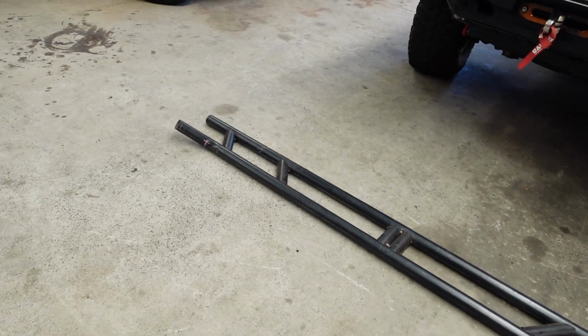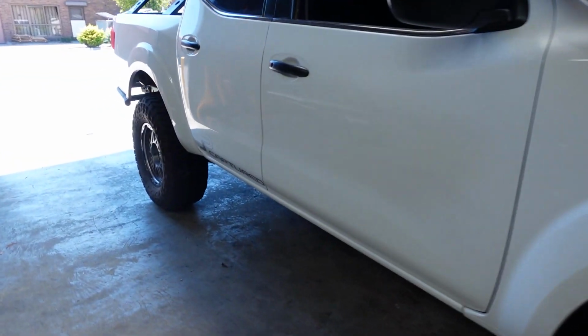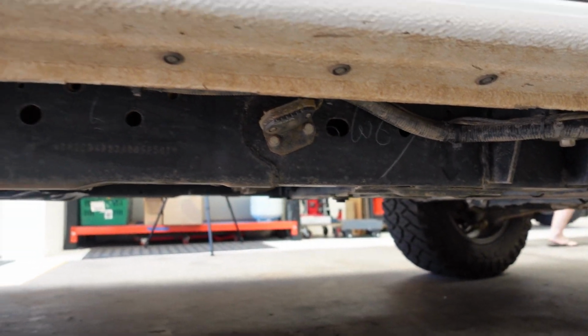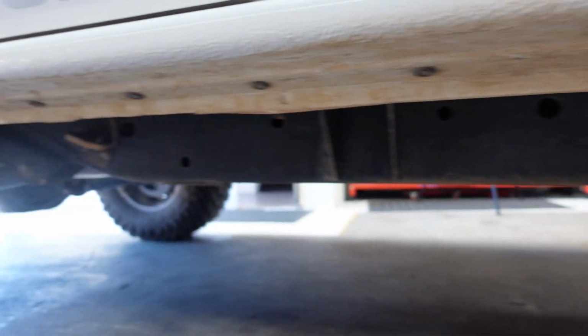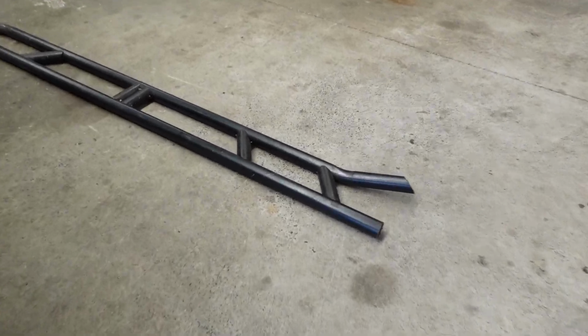Hey, Amy. And so this is the driver's side one. It's got a bit of a kicker on the end. Need to add a cap onto it there on the end, and need to make up some mounts to go onto the chassis. So I'm planning to do some traditional mounting styles, which is basically a U-bracket, which goes from the bottom and mounts up with a bolt through the top holding it into place. So I'll have 3 points of mounting is the plan, and they'll have some notched tube coming off the back of the slider to hold it into position.